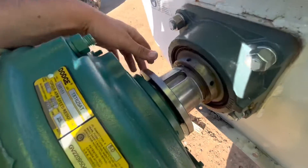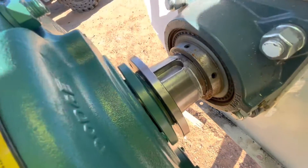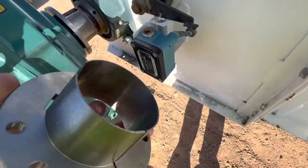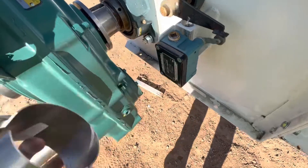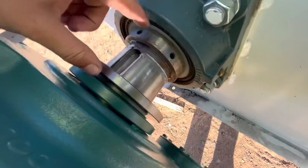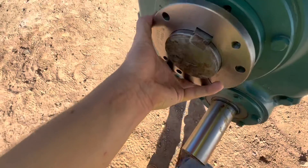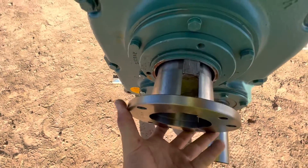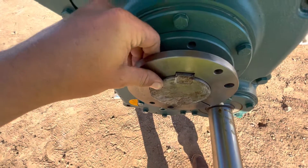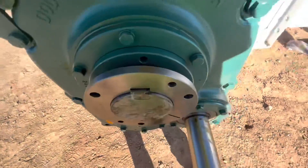Got the shaft all cleaned off. There's this little sleeve piece here — it sits long ways towards the back, kind of like your spacer, holding off the back of the thing. Then this front one — the male part — slides into it over your keyway. We've been having about an eighth inch or so, so it'll sit about like that.